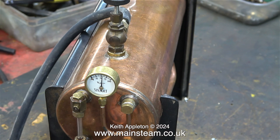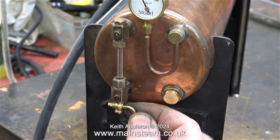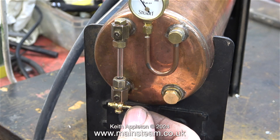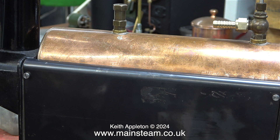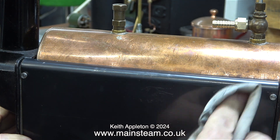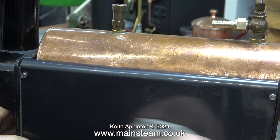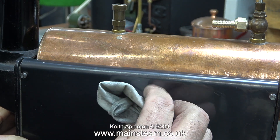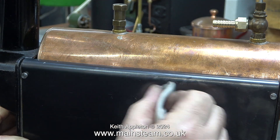I'm just going to test the blow down valve on the water gauge. That's good — it opens and closes without leaking. This clip shows the original safety valve on the boiler, the new tap, and the part that I made. What I'm also interested in are the pieces of sellotape and the adhesive left behind from previously removing some sellotape. Here you can see me picking away at a particularly stubborn bit. Eventually the top layer came off and then cellulose thinners removed the adhesive.